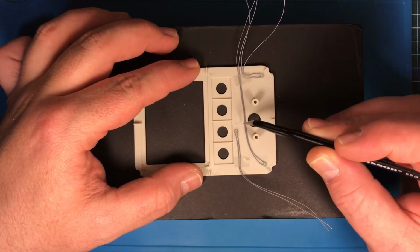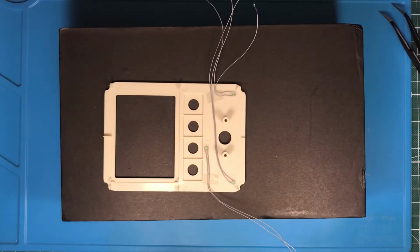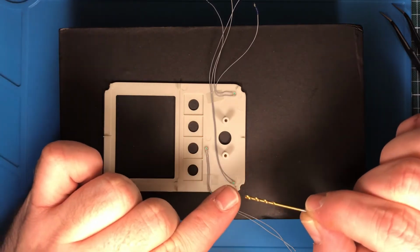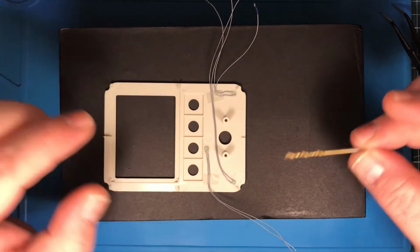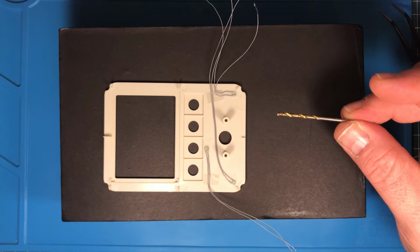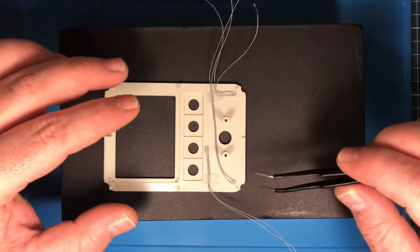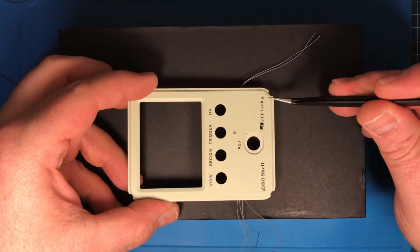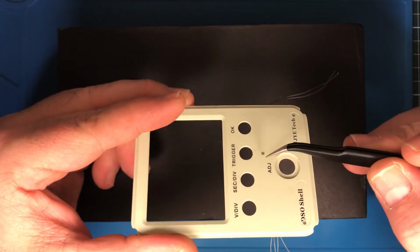And to get the light through, or to see something on the front, I drilled a very small hole in it, using a 1.5 millimeter drill. On the other side, on the side where we see the LED, I used about a 3 mm drill and drilled another little bit, a kind of curve in it. And then I filled the hole with hot glue. After filling with hot glue, it is flat on the surface. Maybe you can see there's no hole anymore.